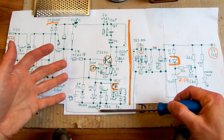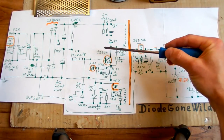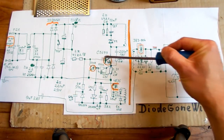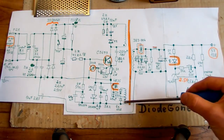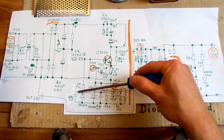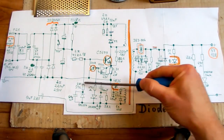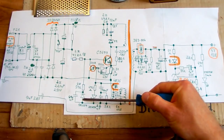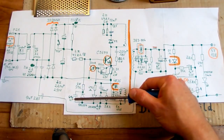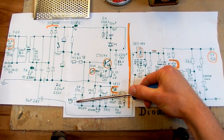Of course, the power supply has to oscillate. It's a self-oscillating flyback, so it basically has to oscillate because there is a positive feedback from the auxiliary winding back into the base of the main transistor. And the feedback probably goes through this side of the auxiliary and through those components back into the base. It's usually just a resistor and capacitor, but in this case there is a diode added, which is strange. Normally it's just a resistor and here a capacitor, and normally it tends to have a lower capacitance. And the capacitor is often used for the timing.